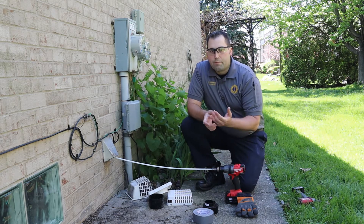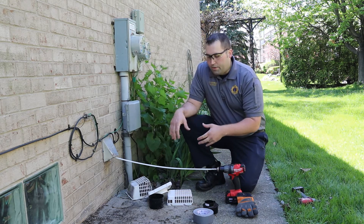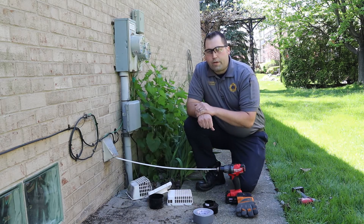You'll make a little bit of a mess outside, but you can clean that up with a shop vac. Now that you've cleaned all this out, we can get everything set back up, button everything back up inside, and run our dryer normally. You also want to make sure to clean the lint trap before or after each use of the dryer. By keeping the dryer and vent clean, that will not only reduce the risk of fire, it will also increase your efficiency, decrease your dry time, and save you money on your utility bills. Thank you for watching this video. Stay safe.